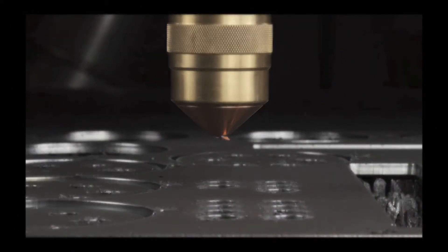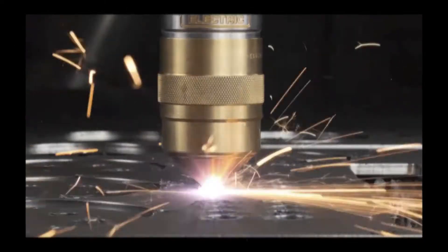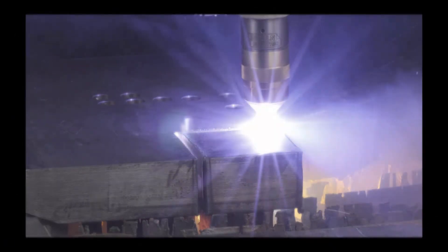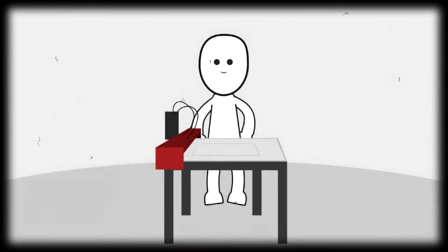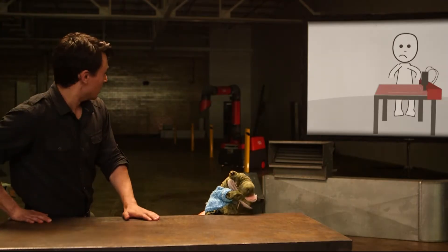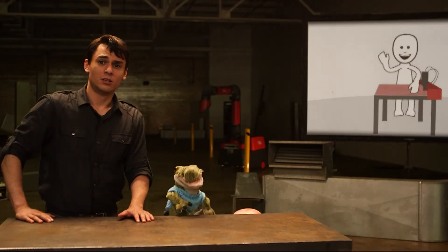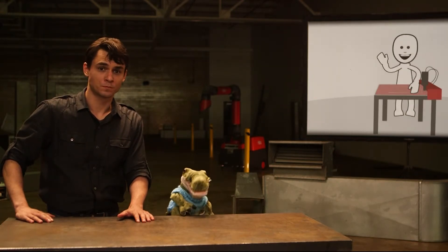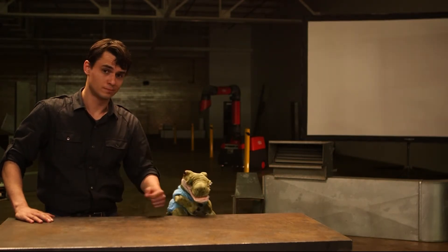Never place an air gun nozzle or direct the airflow toward your body — that can cause an air embolism, which can be fatal. Remember that an oxygen-fueled cutting flame can reach temperatures of up to 6,330°F, while plasma arcs can reach up to 45,000°F. Materials will be extremely hot after they've been cut, so wear protective gear, use a material handling apparatus, and wait for materials to cool completely before attempting to move them. Only trained individuals should work with, on, or near CNC plasma cutters.